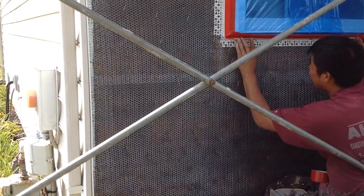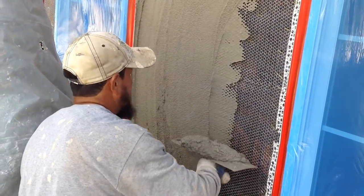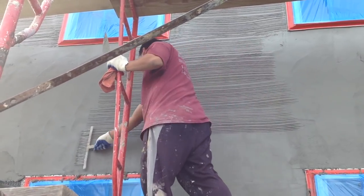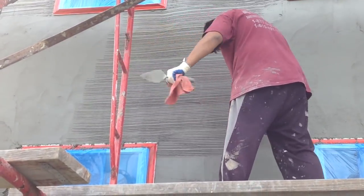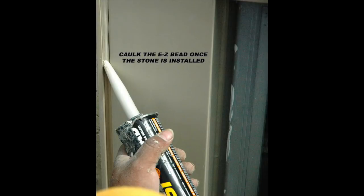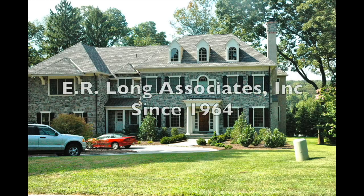For protection, we put window film over top of our windows, and now we're ready to install a scratch coat. The scratch coat is installed at a minimum of half an inch. Once we get this parge on, we'll be ready to scratch it — the scratch is applied with a rake-like tool to give a bond from the scratch coat to the mortar on the back of the stone. Once the stone is installed, we tear off our plastic film protection, then caulk our joints and we're ready to go. Due to energy efficiency, walls do not dry like they once did, so they need help — we really need to ventilate and dry the wall systems today.